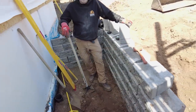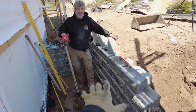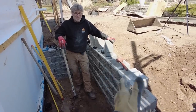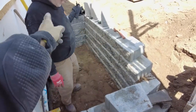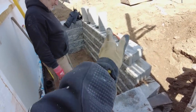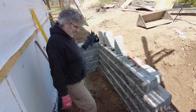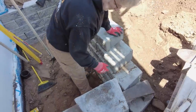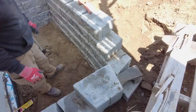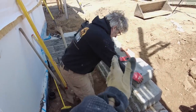But when you're making a cavity, it's supposed to be a certain size. Every single course, the opening gets an inch bigger. And we have two sidewalls, so this way it's getting 2 inches bigger every course. This one's getting an inch bigger. So we're getting creative with the cutting and layout as we go, so we can overlap the corners. We get a nice overlap on the corners because you want that to actually lock together. Otherwise, if this was just a retaining wall somewhere, not nearly as big a deal if it's an inch this way or that way.